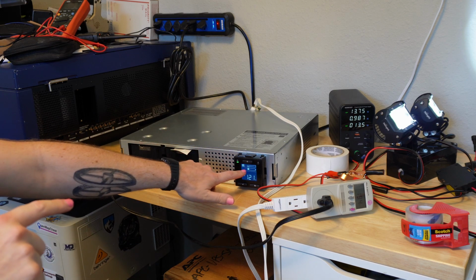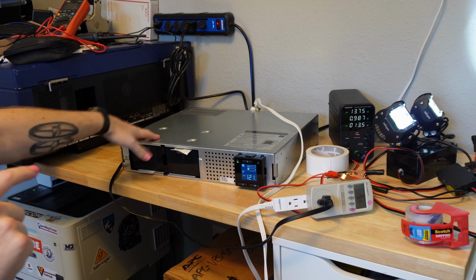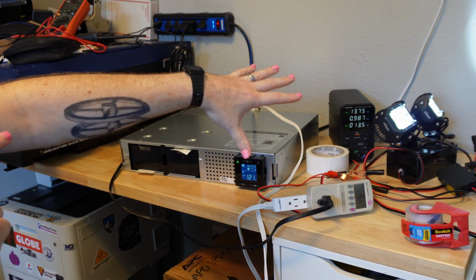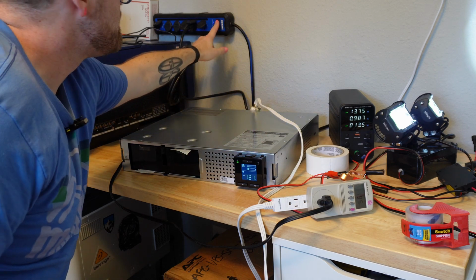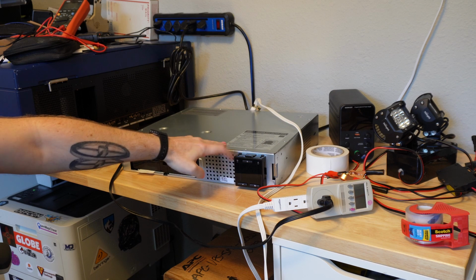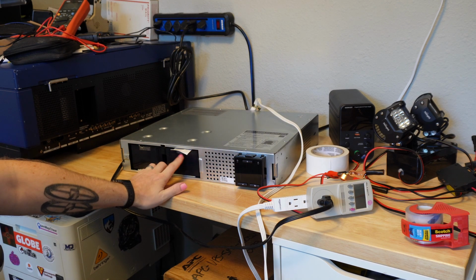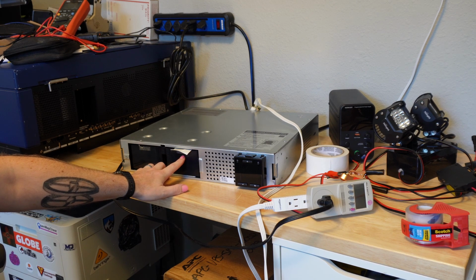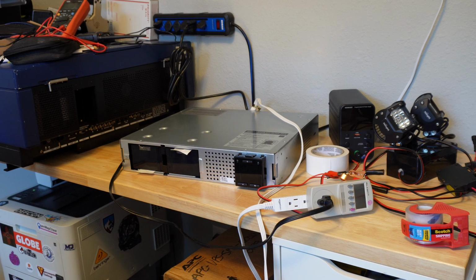This is a UPS, right? So even though the battery's low, I should be able to turn off its input power and have the output uninterrupted, right? That's right in the name. But that's not working out, huh? Whole thing shuts off. So I'm thinking most likely the output voltage of these batteries is falling much too quickly under load. It does this even if it says they're fully charged, by the way.